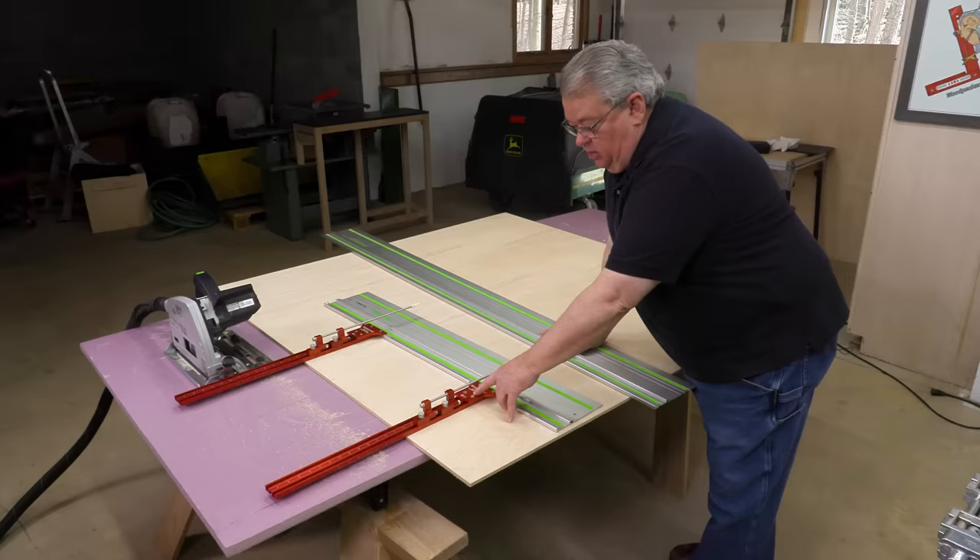Now just to make sure that nothing changed, I'm going to bring the square down and double-check my calibration — and you can see it's exactly in line. Now my first cut is just right at the end of my rail. I need a little bit more to position my stop, so I'm just going to add another section of track. Now we don't need our calibration rods anymore, so we're going to take those out. And I'm going to set my stop according to my cut list, which is 30 and an eighth inches. Now we're going to bring this down until the stops are past the stock, drop the stops, and slide it up until it contacts the edge.